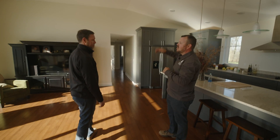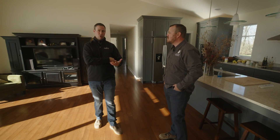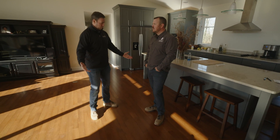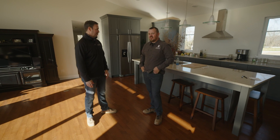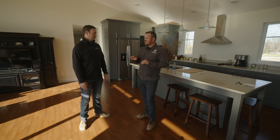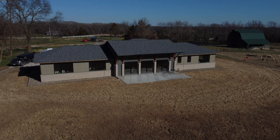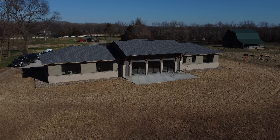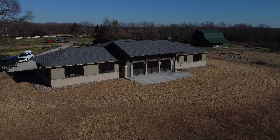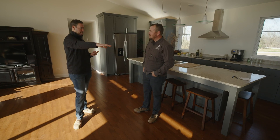With the vaulted half-vault truss design, it's one sheet of rock from the outside to the center on each side — from a drywall standpoint, no rooms have butt joints. The house finished about 18 months to two years ago. Have we noticed settlement or problems? No drywall cracks. We feel we absolutely nailed all the details that cause problems — monitoring humidity, strapping the ceiling, and that Advantec detail around the outside eliminates truss uplift. The only issues are exterior UV-related. No drywall cracks, even though those walls are sitting on a floating subfloor.